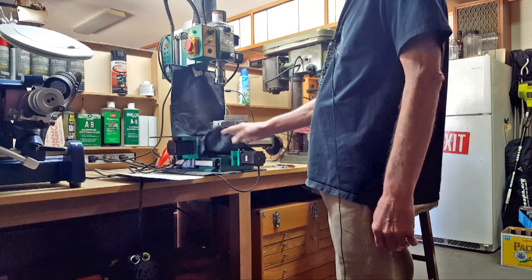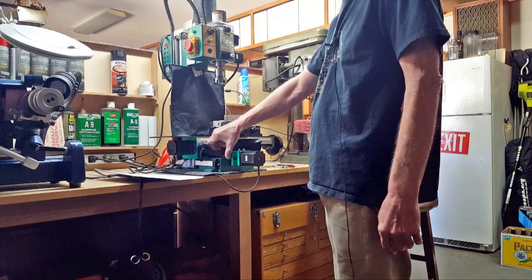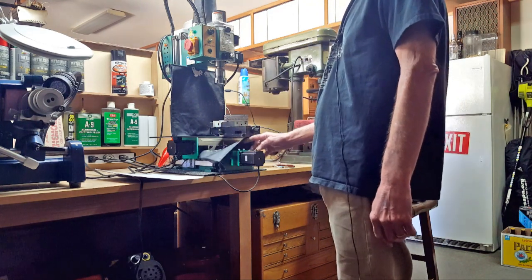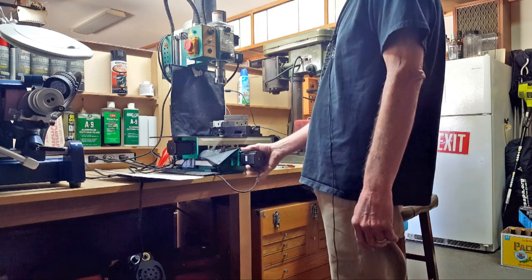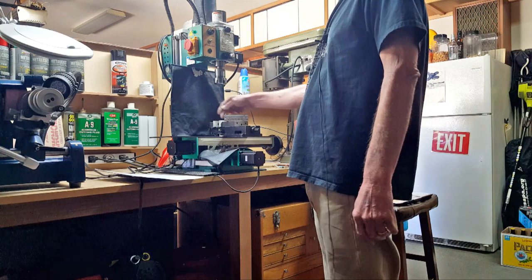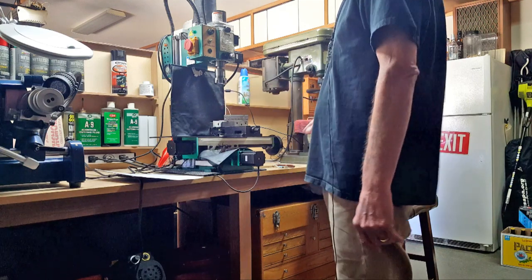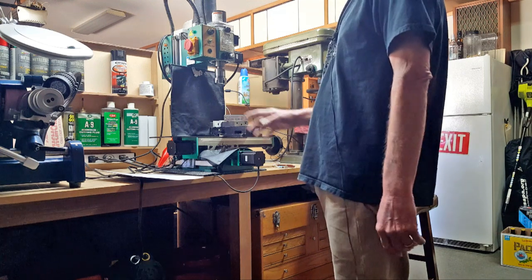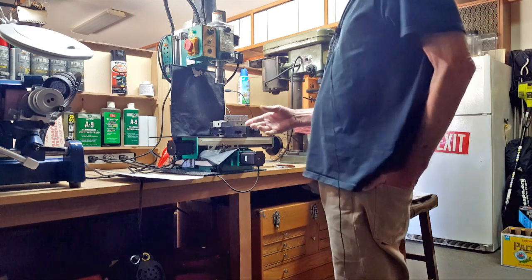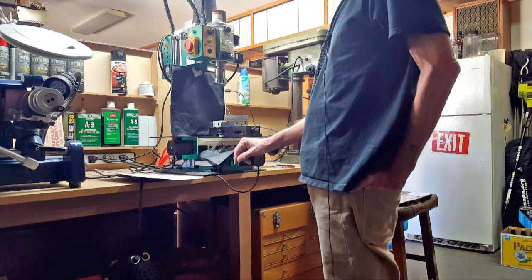The Y-axis — I didn't realize it, but this part actually exceeds the base. So I had to make some little spacers and back the whole thing out 300 thousandths so the end mill can clear the back of the vise. I also greased everything. A lot of the noise and binding problems from the past video were because I didn't have grease on the lead screws.